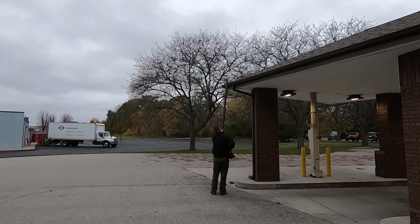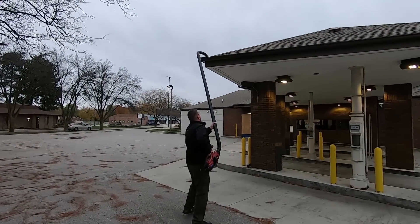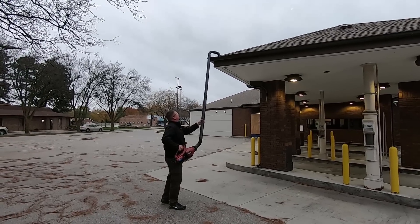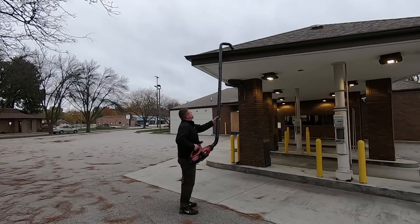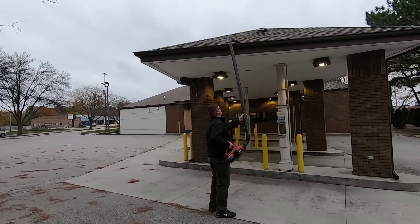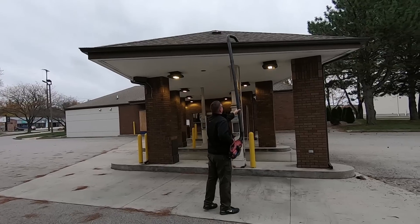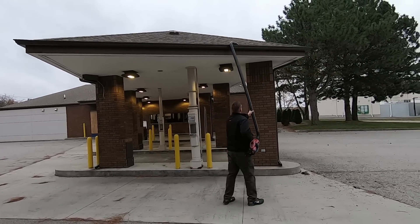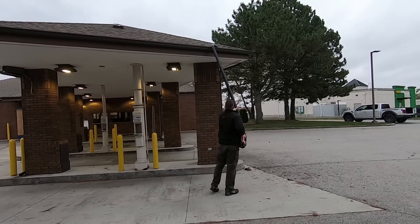This system is really not hard to use — you just have to get comfortable with it. Adjust the strap on the blower and position yourself so things don't blow back in your face. It's nice not to be on a ladder and to stay on the ground, as long as you have a one-story home. It's also best to do this often so you don't have a large buildup. If things are wet, you'll get wet too, so try to do this when things aren't completely soaking wet up there.